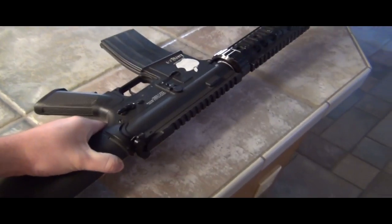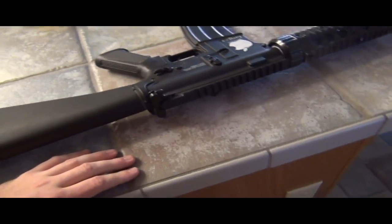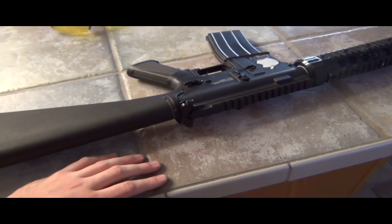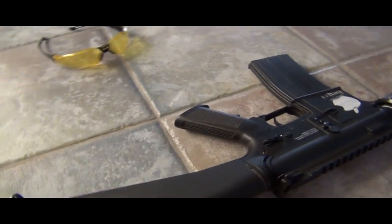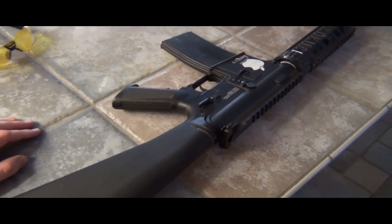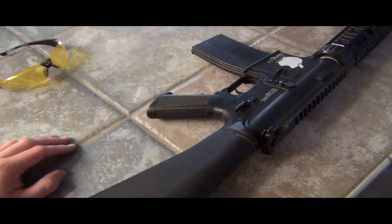I spent probably 2 hours on the shimming. I almost decided to Dremel one of the gears a little bit near the teeth area because I thought there might not be enough room, but I just made sure, kept spinning time and time and time until it was really good shimmed, and then the motor height was at the exact spot it's supposed to be.